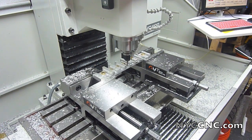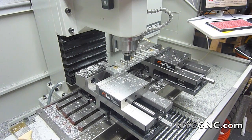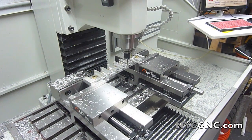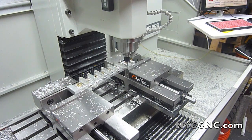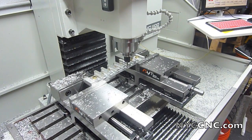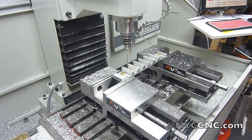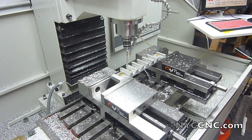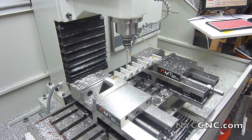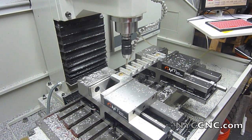This is a little bit of a heavier cut, but it's okay. Now it'll come back and finish off the bottom half. Now using a number 3 drill — I misspoke, number 7 — which is probably a mistake to prep for the tap. Next I've got a quarter inch drill, which comes through in a single pass, and it drills that relief clearance for every hole.